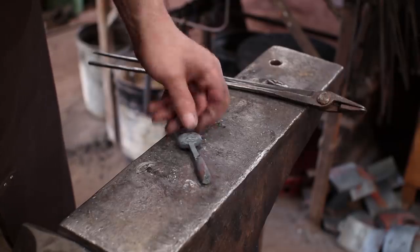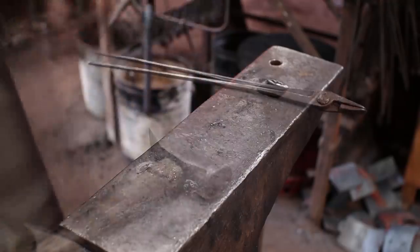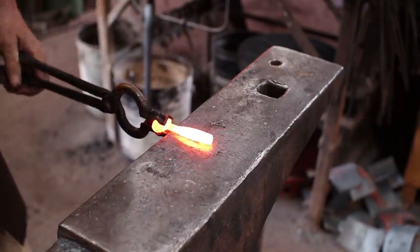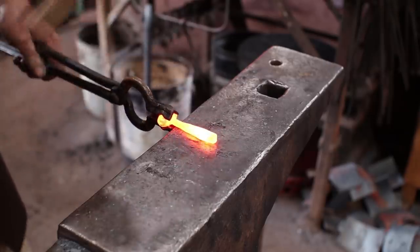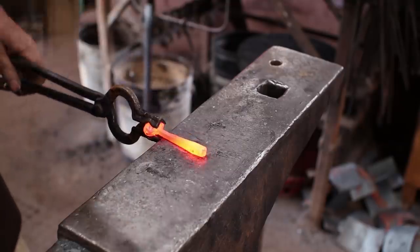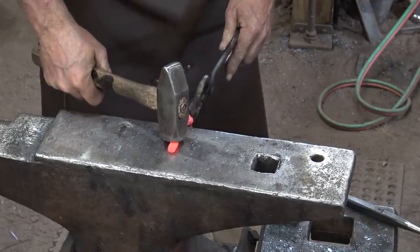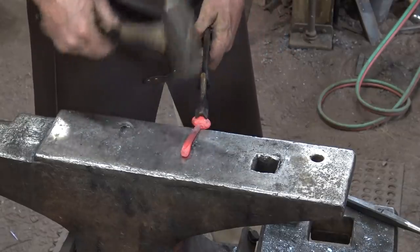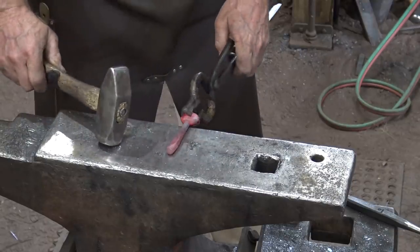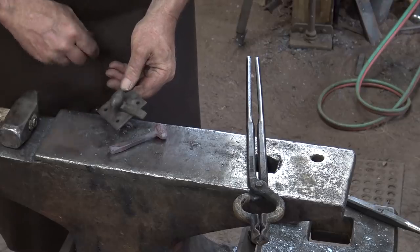While that cools enough to wax, this piece needs to be drawn out just a little bit more. Then we'll need to file it round to put a quarter-twenty thread on there. All I really want to do is just draw this out longer — the rest of it we'll do with a file. By the way, these little knobs were originally a little latch that looked something like this — little cabinet latches.